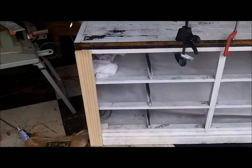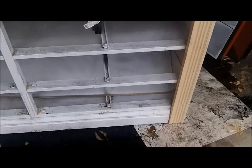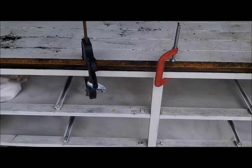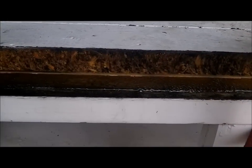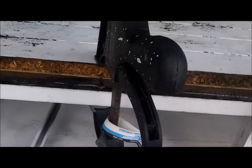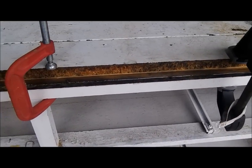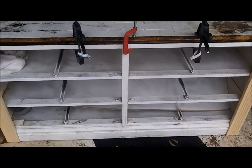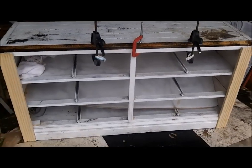Okay, I got the side pieces on. The top was a little bit warped and popped up. Unfortunately the top actually has a particle board center, so I had to glue it back down — put Gorilla Glue and clamp it. We'll let that dry overnight and then keep working on it from there.